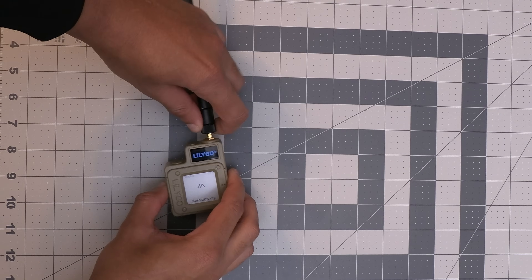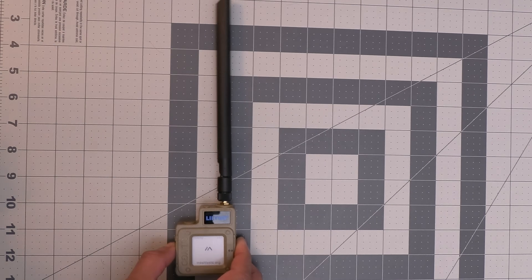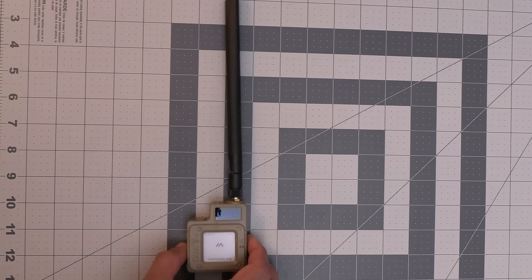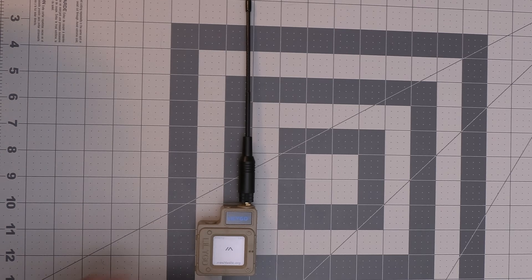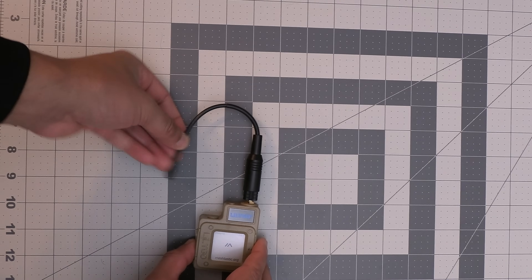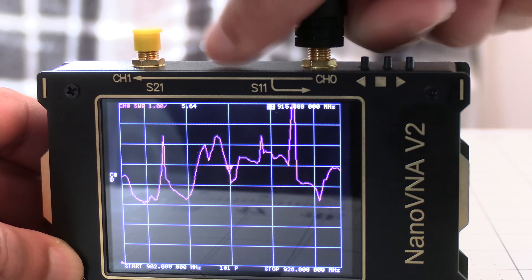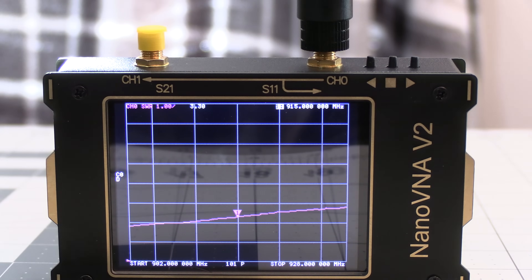I'm a big fan of the antennas from CD-Ebyte that have a good SWR both straight and folded, as I showed in a previous video. But due to their size and inflexibility, they're better suited for fixed applications rather than a highly portable device like the T-Echo. As an upgrade, I've been using this flexible antenna from Gizont, which has been a community favorite. I ordered the 20-centimeter version, but the 17-centimeter version appears to be better on 915 MHz, so I've placed an order for that. The 20-centimeter version has an SWR of around 3, which is better than the stock antenna, so I'll be using that until the 17-centimeter arrives.